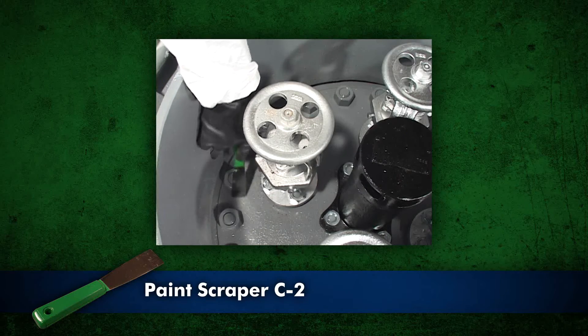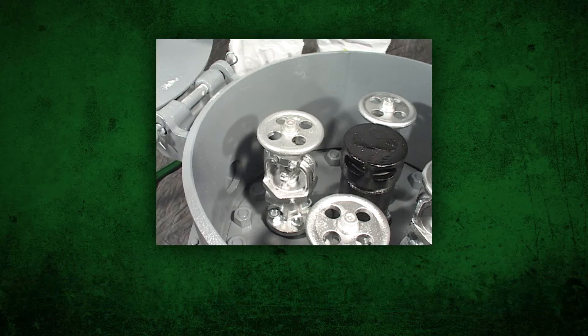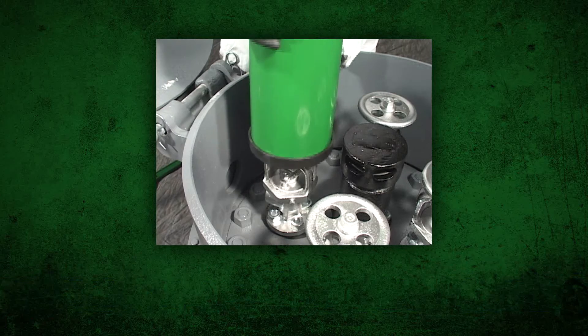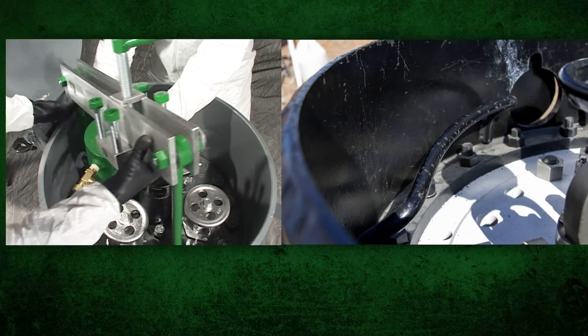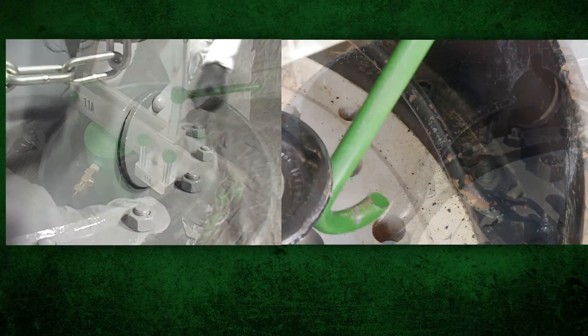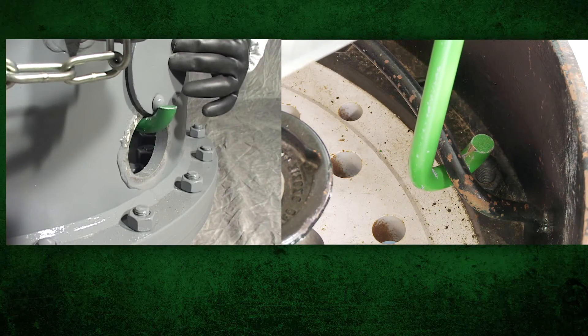Use the paint scraper C2 if the paint is loose or uneven. Place hood 6A1 with the gasket 6BMV over the leaking valve. Place the yoke assembly 11A hooks into the port openings of the protective housing, or to the mounting bars inside the housing if provided.